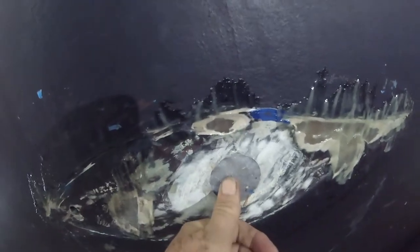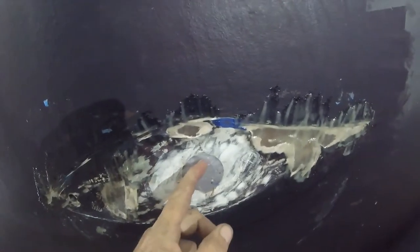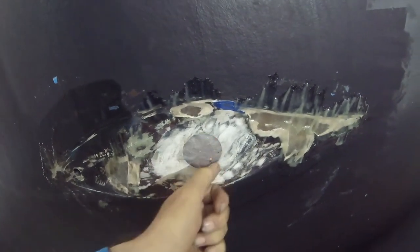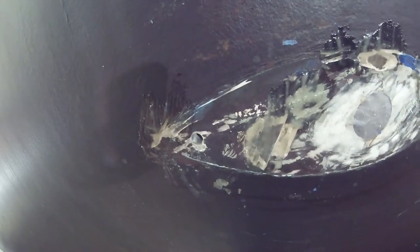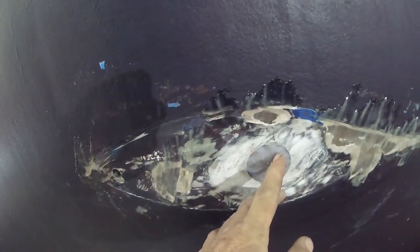Also, this makes it a lot stronger if there were to be a catastrophic accident and this would be sheared off. We're going to have the minimal amount of excess play here. And we're going to end up with a beautiful new surface when we re-drill this for the 5200 to stick to rather than old dirty foam. So it turns out that this front hole from the other transducer can work in this application. So we've dry fitted one bolt and we've dry fitted the gland, so we know everything's going to work.